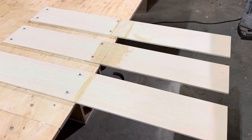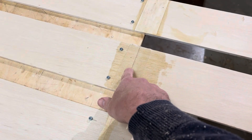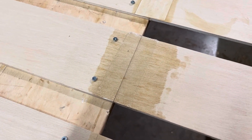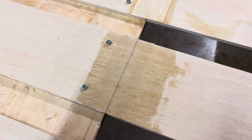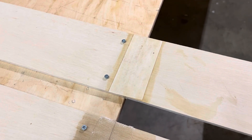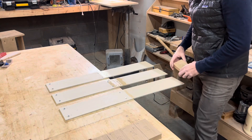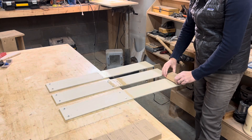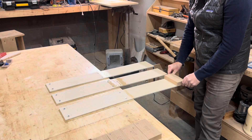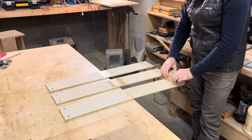I did weigh them before and after gluing, and the heaviest is the fiberglass and epoxy — it's approximately seven grams heavier than the paper. I'm starting with the butt joint only, which should be the weakest joint. The key is that I have to place the weights right at the edge and stack completely vertical.